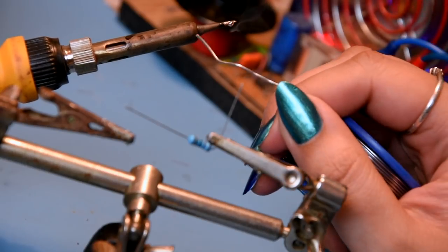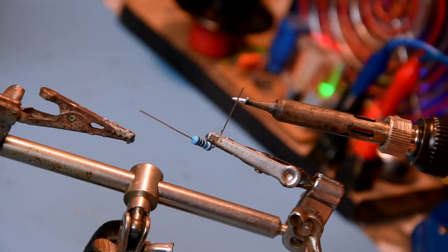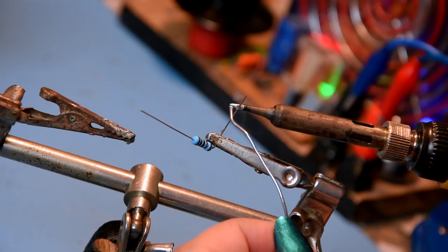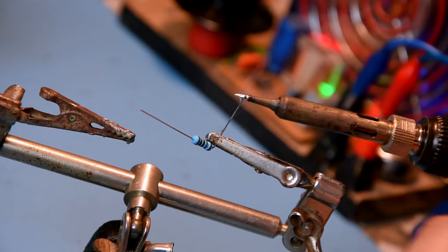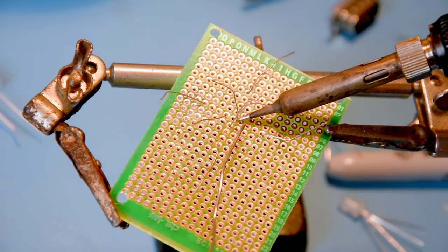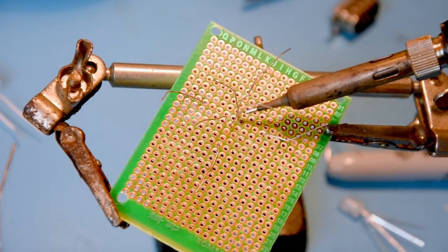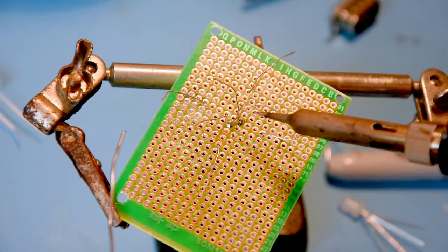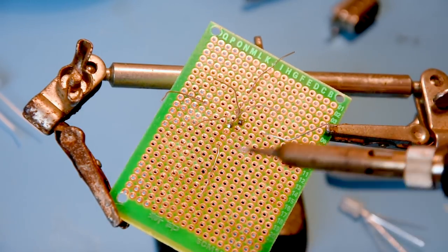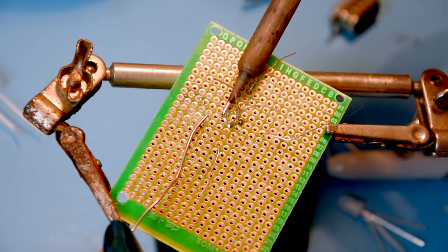What I tend to do is heat up the component and think of it as an extension of the soldering iron - the heat will attract the solder so it sticks on, just like it's doing now - that's successfully tinned. Then put the iron under the resistor leg, heating the leg and the pad at the bottom, and add a tiny bit of solder and it joins. Less is more with soldering - seriously, less is more. With matrix board you always have to solder the component firmly in place.